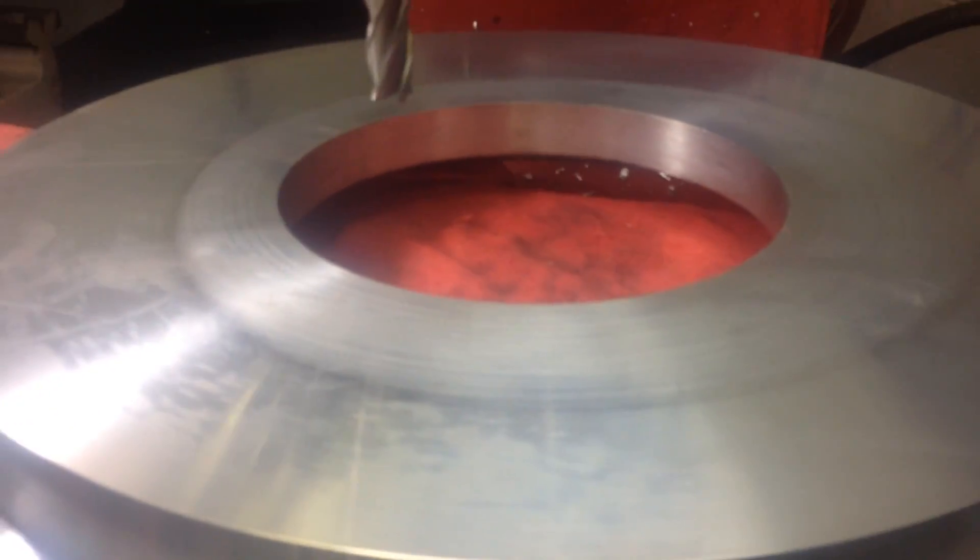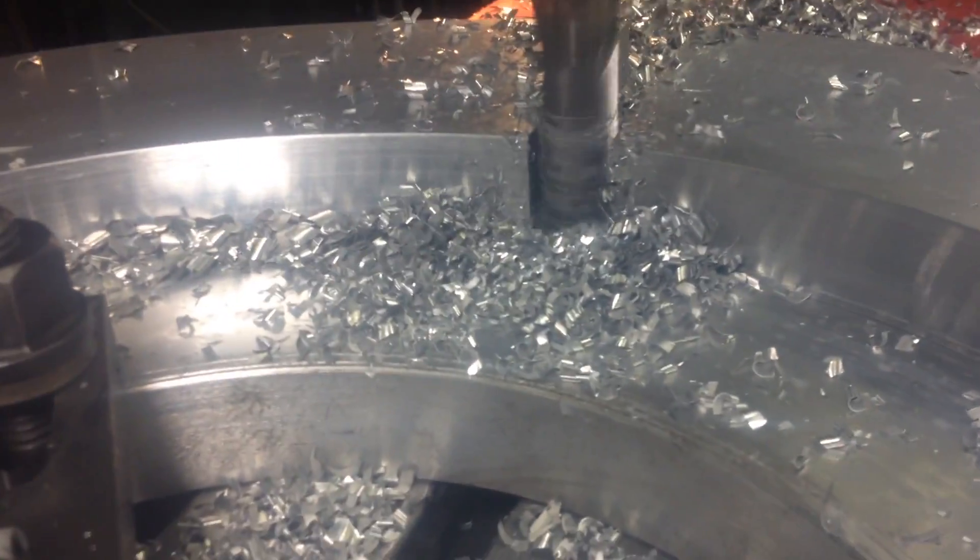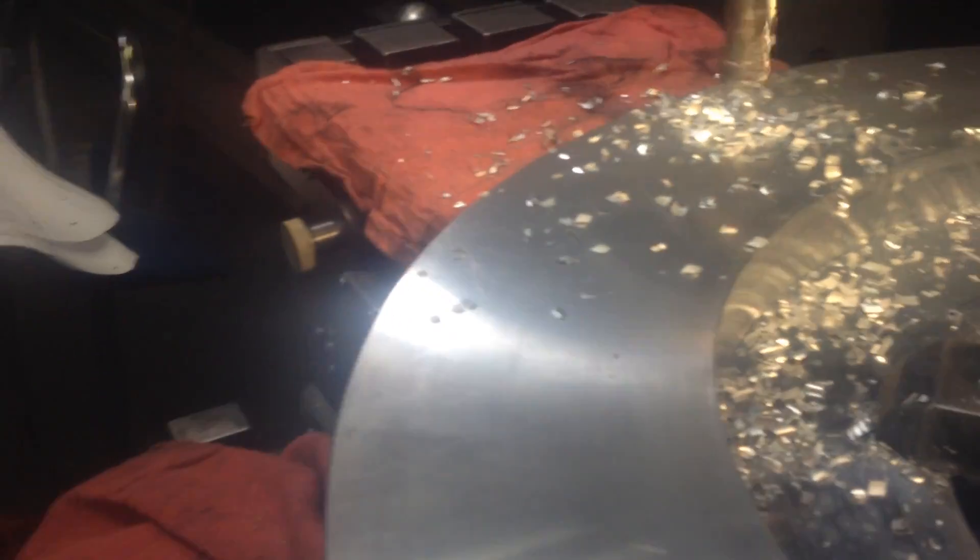Now it's time to work on the mill for a few hours. I have the end mill really slow just because I want to see the chips jump all over the place in the video. But you can go over a thousand RPM with aluminum, it's not a big deal. That's just a — I think it's a 7/8 end mill, I can't even remember.